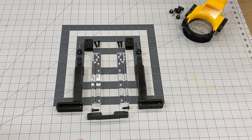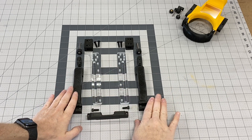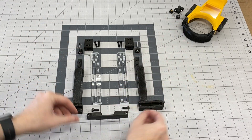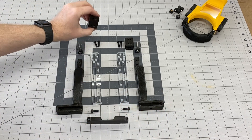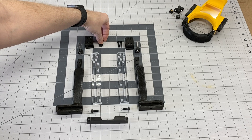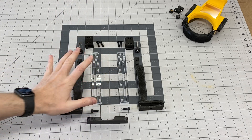What I have here is two track brackets, a left and a right support arm, a couple of 3D printed T-nut plastic parts, a couple of thumb screws, a stabilizer bracket with a couple of attachment screws, two ears for attaching to the carriage, and two long M5 screws. You may have extra screws in your bag, but this is all you're going to need for this installation.